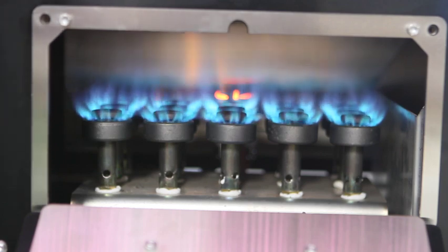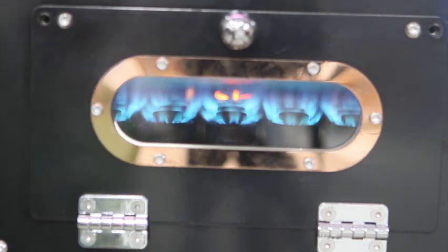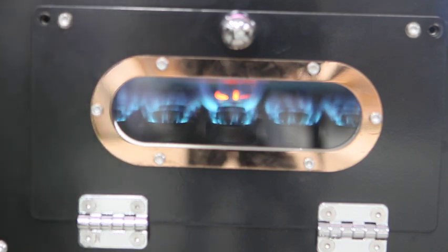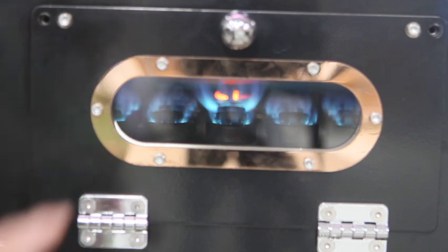On the BC-8, you can see pretty well with the door closed. At one kPa the burners look strong; at a half kPa they're reduced. I've got the manual dial damper set to three because the amount of airflow affects the way the burners look. Turning it down to a quarter kPa, you can see most of the burners are barely lit except for the pilot light burner.